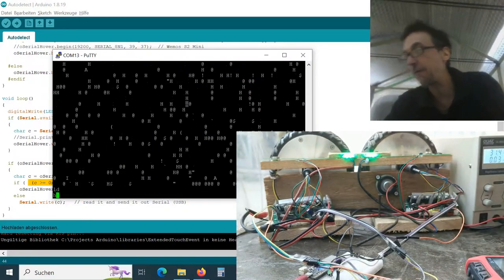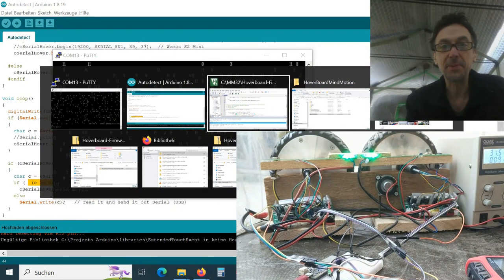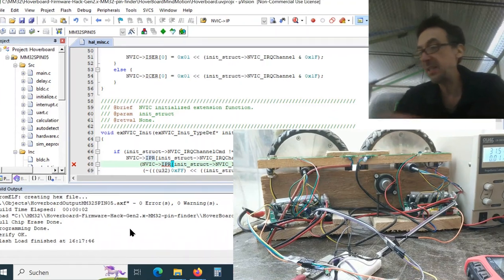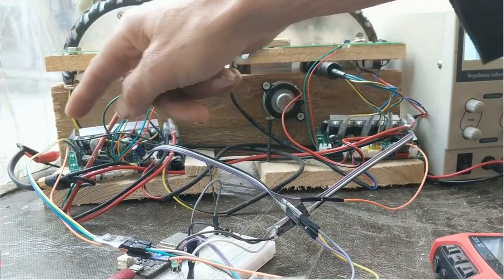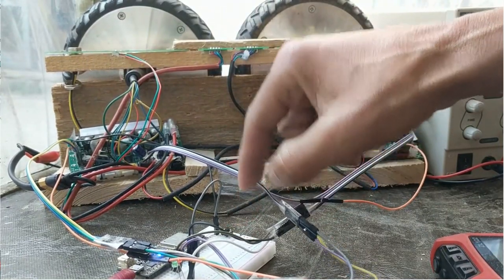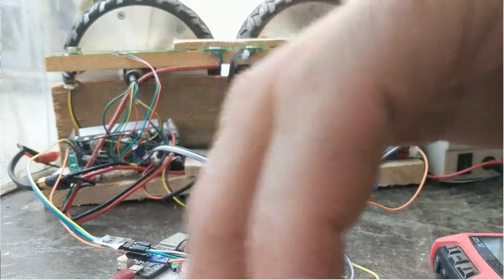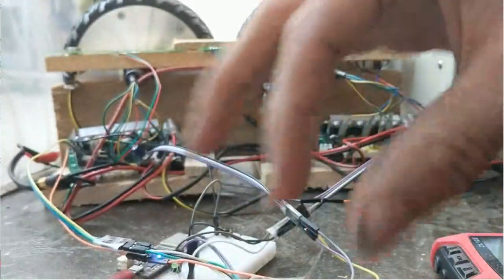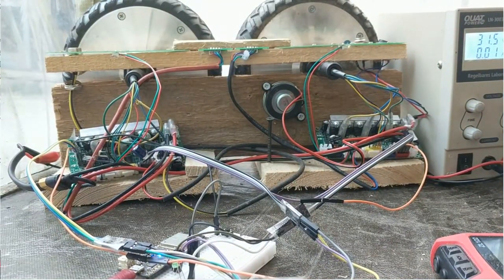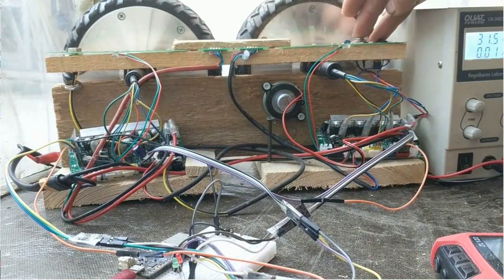Let's continue and now flash the master. It has stopped — we already compiled it. Press F8. In the beginning you have to reset — I have a switch connected to ground so you can manually reset the board. Or you pull the plug off of the ST-Link dongle, insert it, and hit F8.